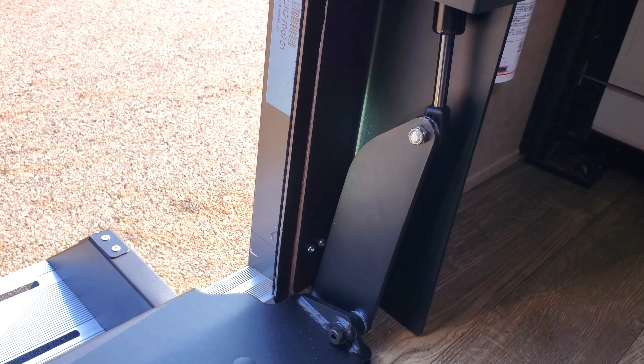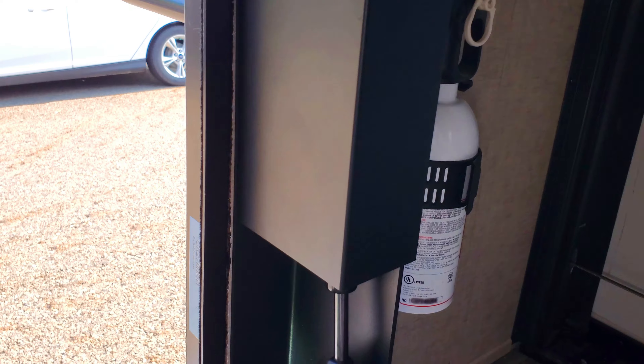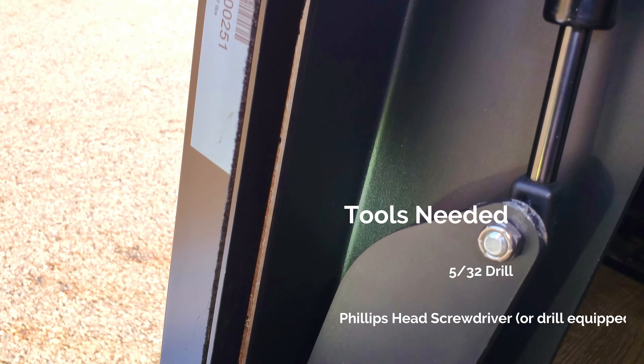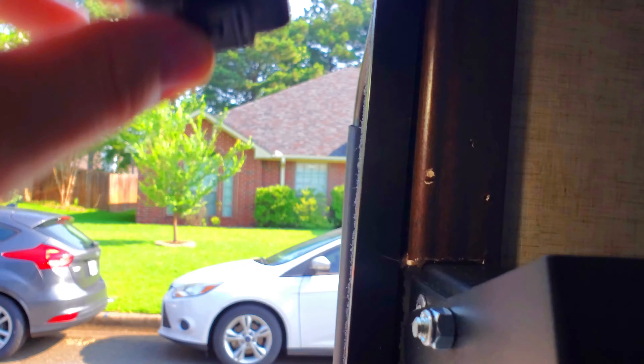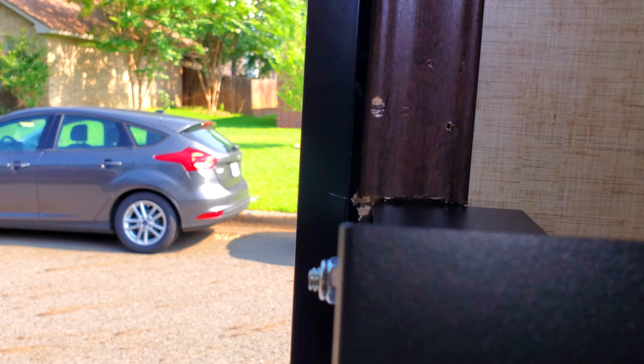Now this is what the lift assist kit looks like when it's installed. The plate that mounts into the wall has a little guard that covers this spring right here. The plate itself is attached to the wall with eight screws, and I did use a pilot drill before installing these wood screws in the wall. The only thing you really need to know about the installation of this part is that you will probably have to move your fire extinguisher. You want to get this bracket as close to the middle door frame as possible — probably a quarter of an inch from the metal door frame. You will need to cut some of your molding in order for this plate to fit in.